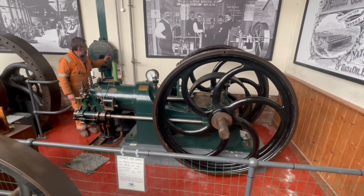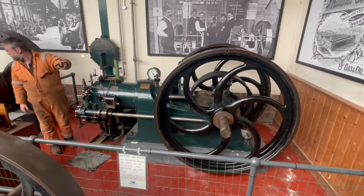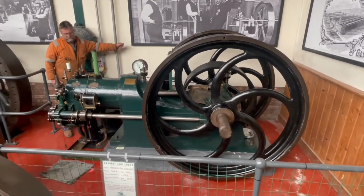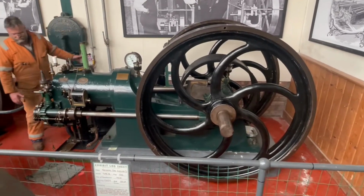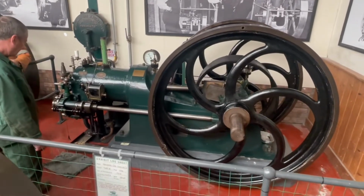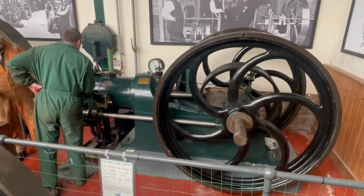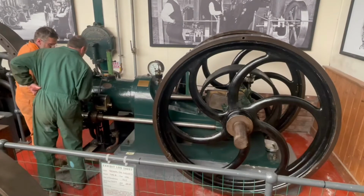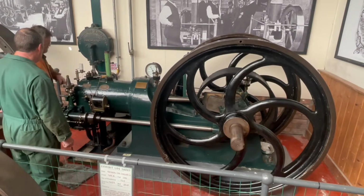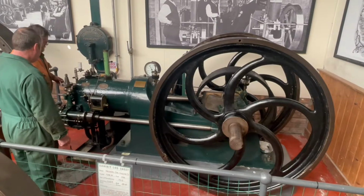Compressed air to start is on there, and there we've got just a bit over 150, which should do, maybe. So we turn the air on. That's right, we've got that one in, so we've got decompression on, because if we try and start it on full compression, it won't keep going. So we start it on half compression. Oh yeah, that's got me close. Those are big loud noises. Oh, forgot to do that, but never mind. So I think we're there. Okay. Yeah, there we go.